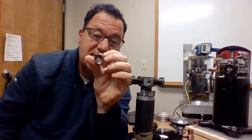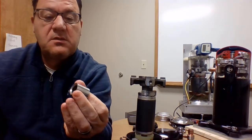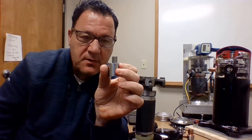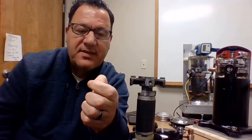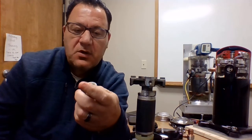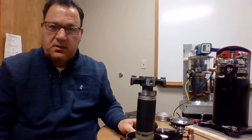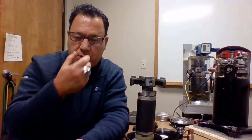That unloader bushing is key because if you notice there's a little piece of steel. See if I can pull it out. There it is. That's inside there, okay, that naturally wants to go straight. We put that in there in that D shape, if you will, causing that to almost act as a spring, okay? So that's what we call our radial compliance, that left and right. So that tolerates any type of debris that might get in there. Debris could be defined as a droplet of refrigerant, okay?